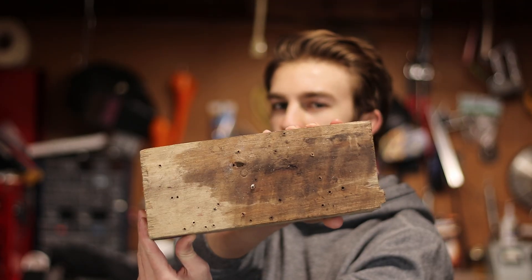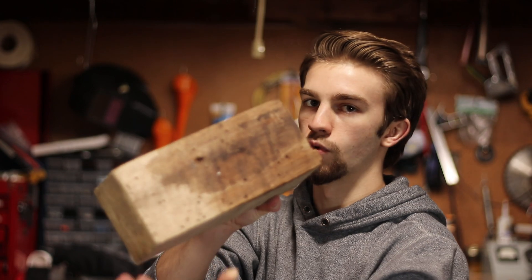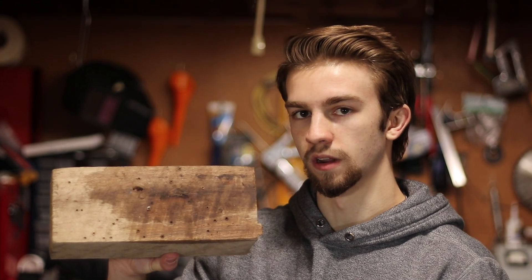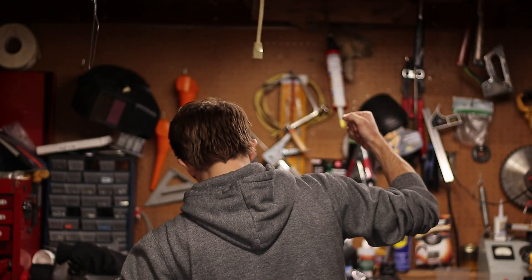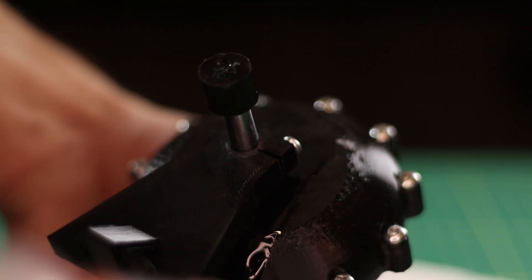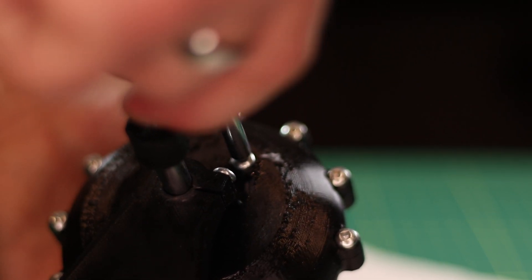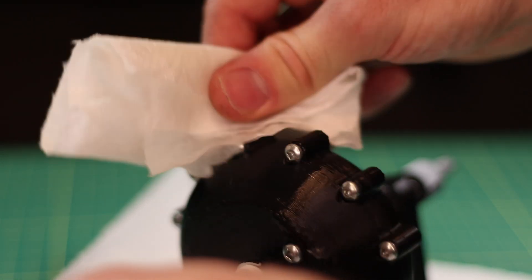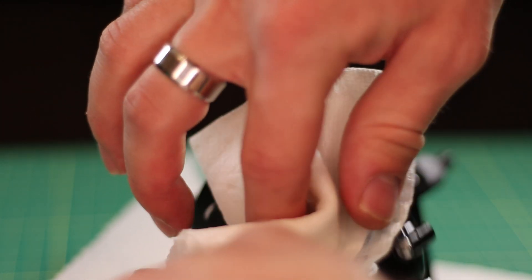Just before I move on to doing any tests, there were a few comments concerned about it leaking oil. When I filled it up the first time, I spilled a bunch of oil onto it, so it was really hard to tell if it was leaking because there was already oil on the block. So what I'm going to do is fill it up, mass it at the beginning, and then at the end of the video take the mass again to see how much actually leaked out. I'm filling the coupler until it's overflowing so we know it's full, then wiping off any excess for an accurate measurement.